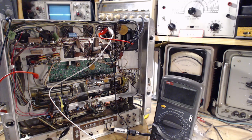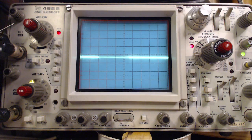Okay, let's watch the scope for the tremendous excitement and listen. Here we go. Well, I don't hear a hum anymore. No hum. I'm now going to disconnect the auxiliary capacitor. Voila, the hum. Okay, so we've identified a place we can add capacitance to knock out the hum, but I've used a stupidly large capacitor. We could use that. Put it in there. I think the set would be just fine.